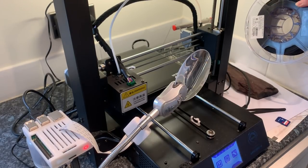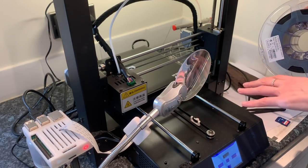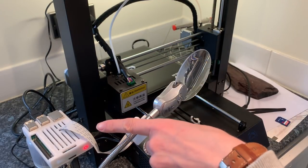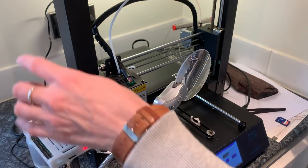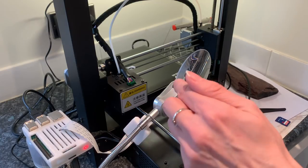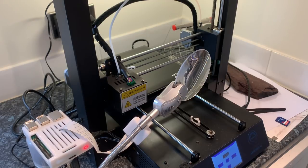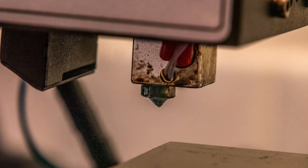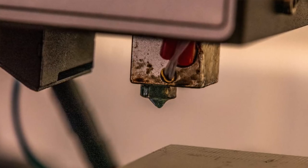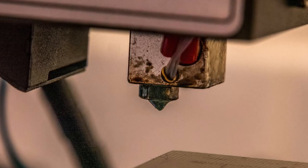The first thing you need to do to get the filament in is to heat the printer. Whilst this is heating — it will make a fan noise in a minute — I'll talk you through my 3D printer. Over here we've got my OctoPi, which is my print server in a protective case — it's a Raspberry Pi, plugged in and plugged into the printer. This is the little camera on a stand. That's the fan coming on, which blows cold air onto the nozzle head. This is the nozzle attachment where it prints — the filament hits a heating element, is melted, and squirted through the nozzle onto your bed.